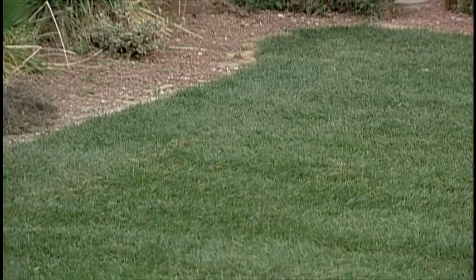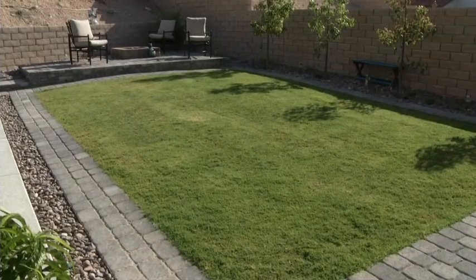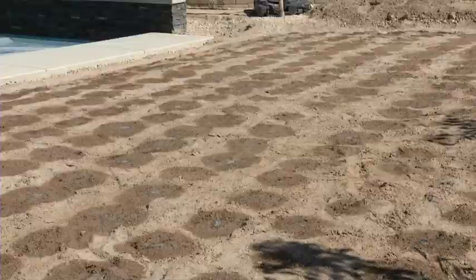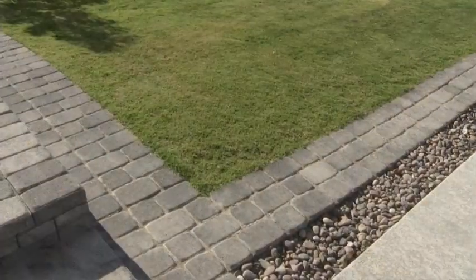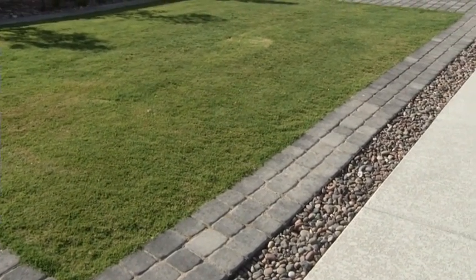The quick check is to visually look at it and see how the lawn's doing. If it's drying out, you're not putting enough water in the ground. If when you're walking on it it's like a marsh, you're probably putting too much water. Really, to find the appropriate amount, you look at it before you even put the grass down — run the system several times and make sure there's good coverage across the ground. That's the best way to ensure you're delivering the right amount of water.